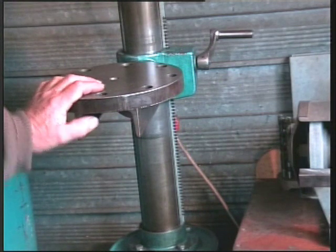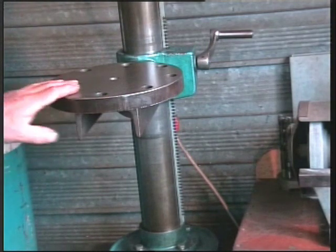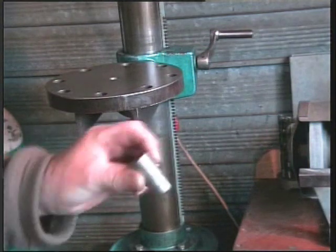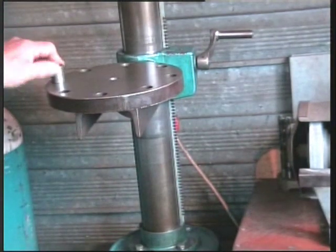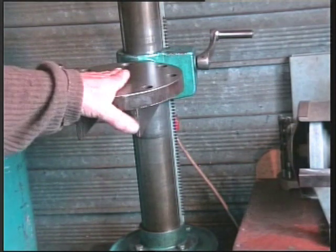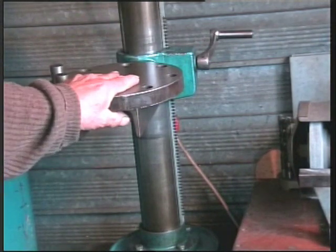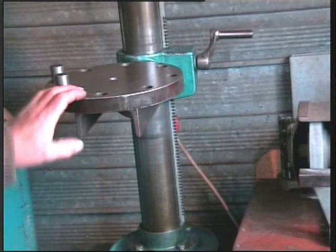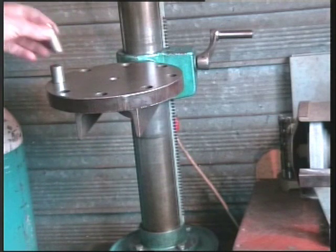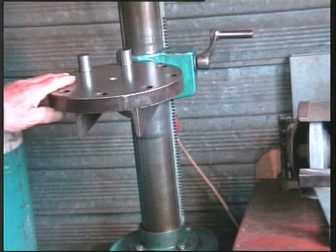And it actually turned out quite well. It's solid, it's flat, and I've made use of the holes around the outside. I've turned up some simple plugs that drop within the holes. So if you're turning something by hand, although theoretically of course you should bolt everything down to the table, but if you're just doing a quick job, something thin, to stop it riding up the drill or coming round and smacking your fingers, this is quite handy. So that's an improvement, but one shouldn't have to do this, of course.